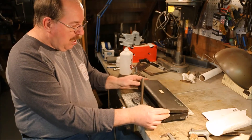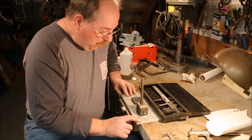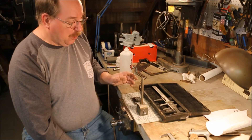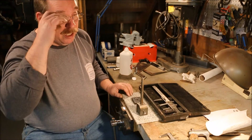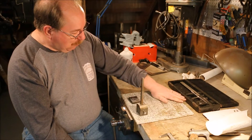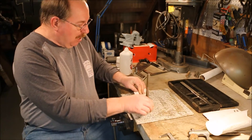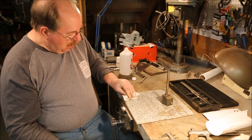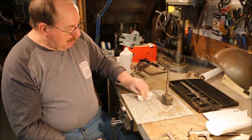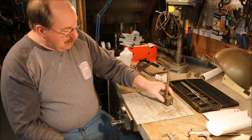There's an easier way to do it — it's called using a height gauge. Now this is by no means a surface plate. This is a stone tile that I got from a stone tile store. I went in and said could I buy a piece of stone, about a foot square, and they said just take one of these tiles — gave it to me for free, which you can't beat. It's flat. The same equipment they use to make surface plates they use to make these little tiles. It's probably not within two tenths of a thou like a tool room surface plate, but I'm just making something for my workshop. A surface plate would probably cost a hundred bucks and I'd use it once a year, so it's really not worth it — this plate works just fine.